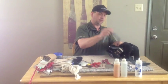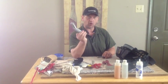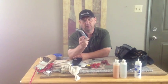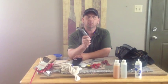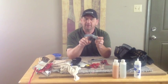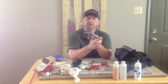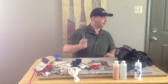And then I have my carpet knife to cut from the backing of the carpet to make sure that it cuts well. And this little tool is about a $20 instrument. This is my cushion cutter. And I don't know what I would do without it. When you are cutting cushion to remove from pet odor contamination jobs, things along those lines, you see how it has the entire length of the razor blade, and that's what you need to cut the cushion in a straight line, to put new cushion in a straight line and do your duct tape as the standard suggests. So there you have it.